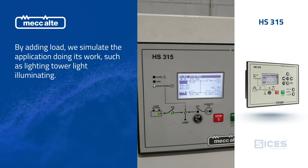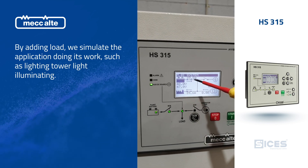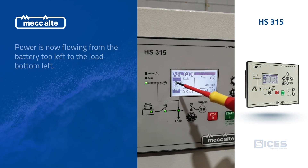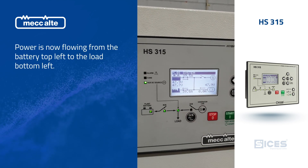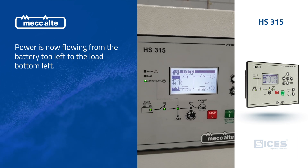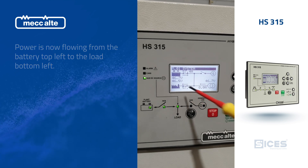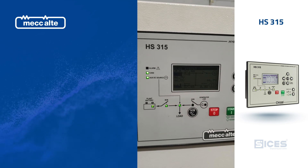At the moment you can see we're pumping out almost 40 amps of load — that's coming from the batteries, none from the generator. So we are dropping to 47.9. I'll put on a little bit more load. We should call for a start any second now because there is a start delay. We're at 46.7 — here we go, we're starting.